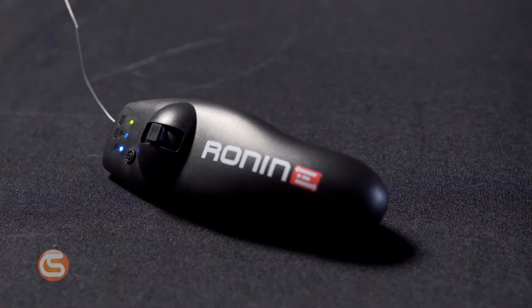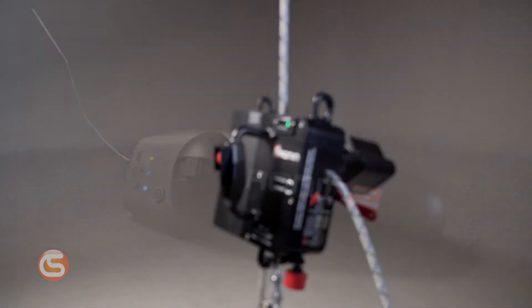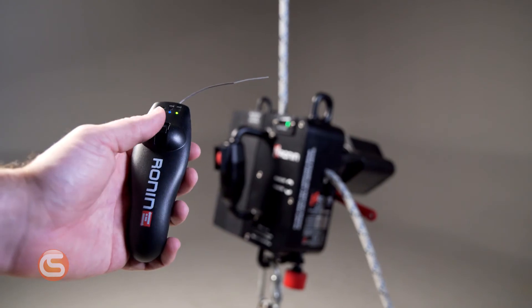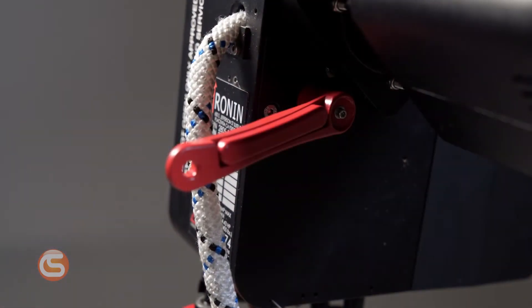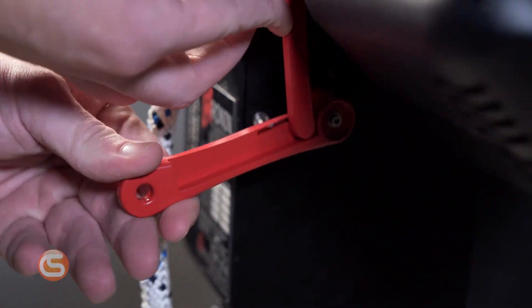Next, Ronin offers a remote for this tool. This remote works within 300 feet line of sight, has a 10 hour battery life, and is programmed to each specific device through Bluetooth — so one remote will not work for multiple devices. A common use for the remote would be to get multiple climbers up a structure using one Ronin device. However, this also requires a specific brake handle that will latch the brake into open position and allow the remote user to lower the unit back down. Just as a disclaimer, the remote is not designed to work for rescues, as the brake handle must be manually open to allow the device to descend.